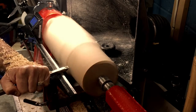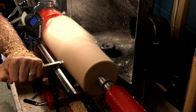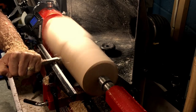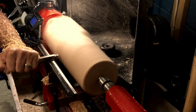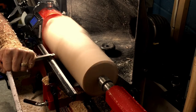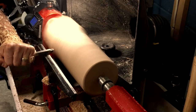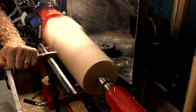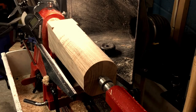On a side safety note, you should not wear jewelry while turning — I always forget to remove my wedding ring. And you should not wear any baggy clothes either. Speaking of safety, you'll probably notice that I'm stopping periodically to check. That's because of the crack that ran the length of the spindle — I want to make sure that crack doesn't get worse and cause a safety issue, or I want to make sure that crack is disappearing. Luckily, the crack did disappear.